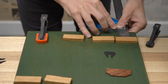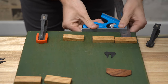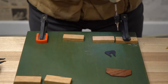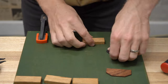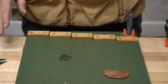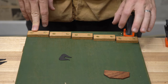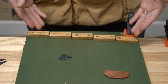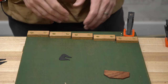The 25-degree stop block is set to an inch and a half. I have my square set to an inch and a half, then carefully place a clamp over it. One quick note: if you finish this and it looks a little off because things aren't perfectly square, it's honestly okay — it's a little hard to keep these perfectly square when screwing them in. What matters more than exact distances and exact angles is consistency. As long as whatever you're using on each stop block is consistent, that's the most important thing.